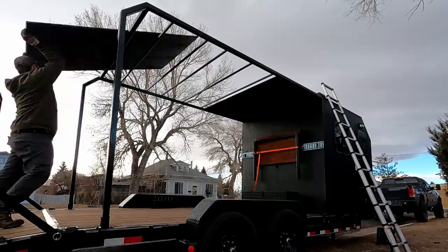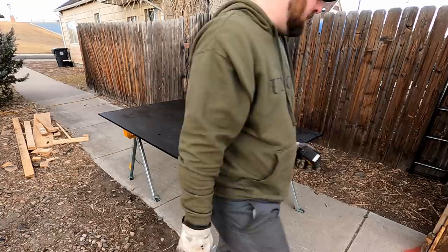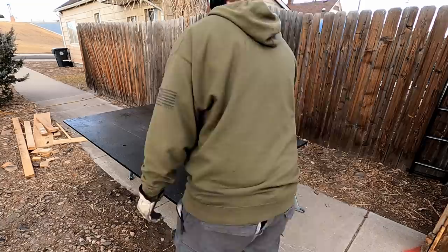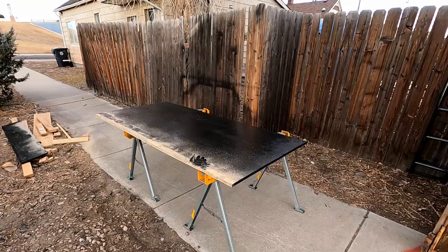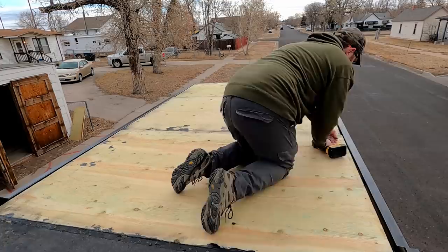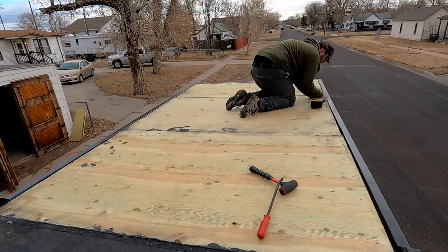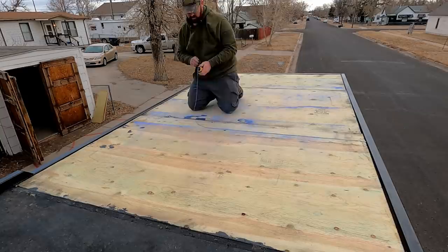I had to take off my old ladder so I'm going back to using my side ladder until I can make a replacement. I'm measuring and cutting the last board to length since it's shorter than the standard 4x8 panels I was using. I cut it nice and neat, clean up the edges, and start screwing down the panels using wood-to-metal deck screws — they're self-tapping and drill through the wood perfectly.